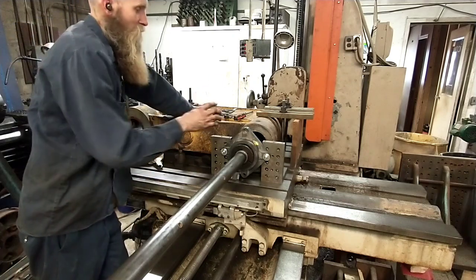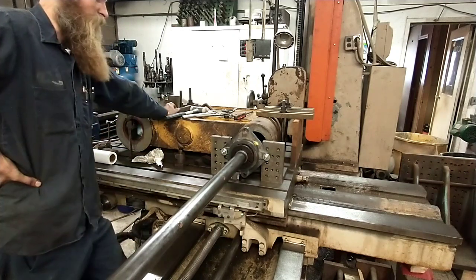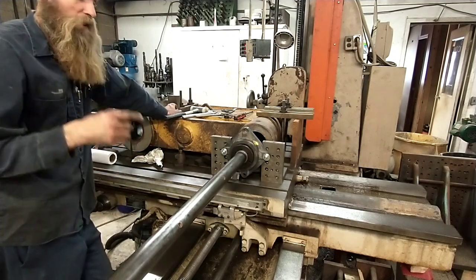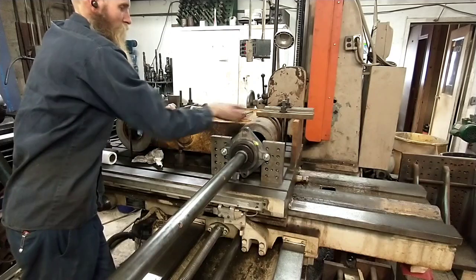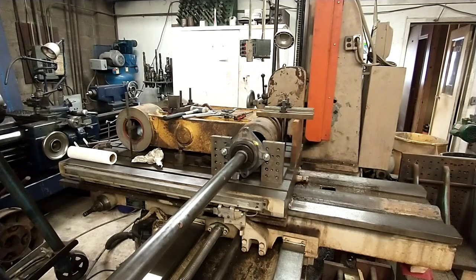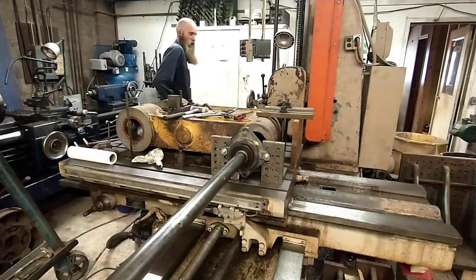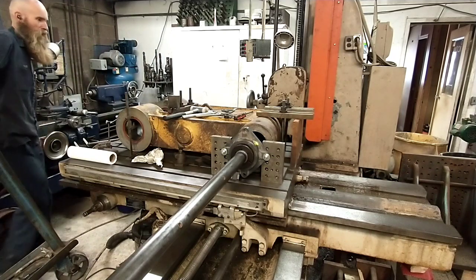So now I've re-set up and picked up the outside of this housing. I'm quite confident that this machine was originally centered on the outside, and there's a grease fitting with the center hole through there on the shoulder — a relatively unmoved reference section. I've been pretty much on center from the outside of the housing. That part took a while because I had one of those spidey senses that it wasn't right. I'm pretty much ready to take the first cut now.